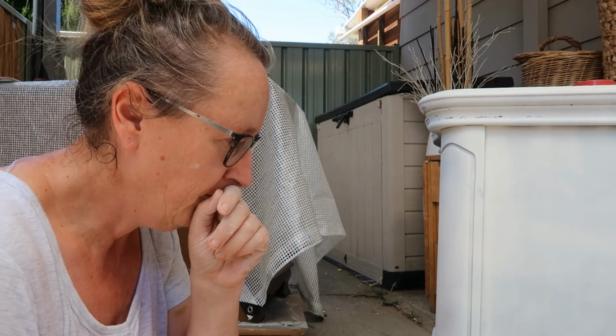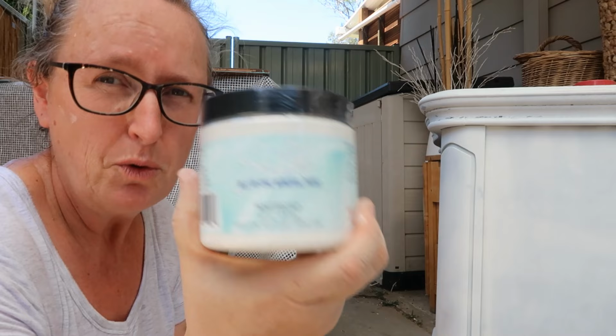Right, so now I'm going in with the paint, and after all of the feedback I got from lots of you, I'm trying Dixie Belle Silk White Cap. A lot of the feedback I've seen says two, sometimes three coats. Some even haven't used a primer. Now, I wouldn't do that with white because you don't want to risk bleed through and then have to sort of pretty much start again by going back to primer.